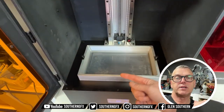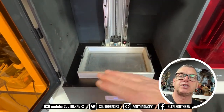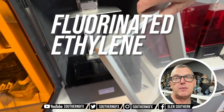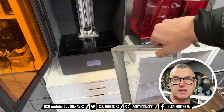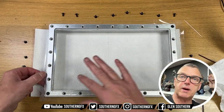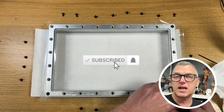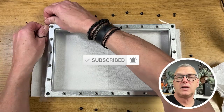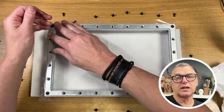When you have these printers, they have a tray, and in the bottom of that tray is a clear plastic sheet called a FEP — fluorinated ethylene propylene — which is a hard thing to say. Basically, it's a clear sheet that the light shines through. We'll talk more about it in other videos, but sometimes that gets damaged and we have to change it. This video is all about changing that FEP, and it's specifically for this machine, but you may want to have a look if you've got any of this kind of printer.